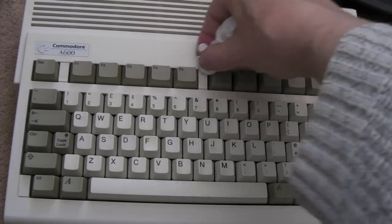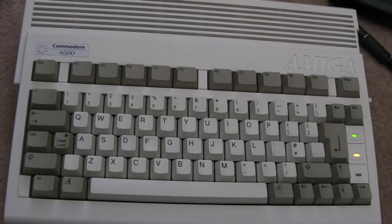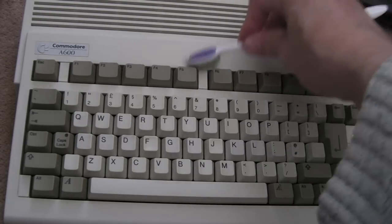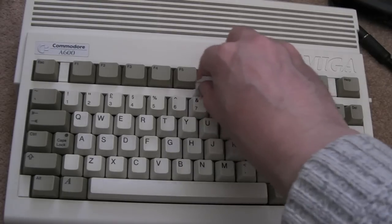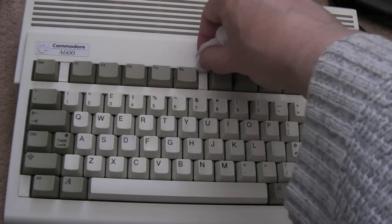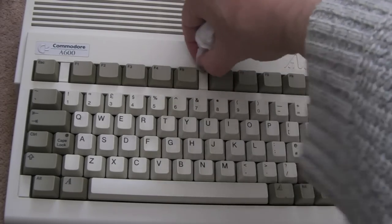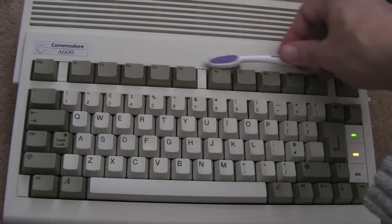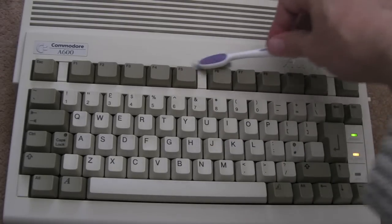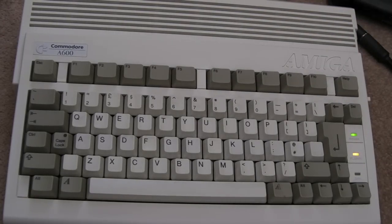So it was like a back burner repair where he did the recap, but he then encountered the problems we've seen, namely the red screen thing and I think the keyboard playing up as well, because that's probably why he swapped the CIA and the MCU. But ultimately, this is a good example of why just swapping things to try and resolve a problem, if you don't know where to look, is not the best thing to do. The best thing to do really is to stop in your tracks and have a think about the behaviour.